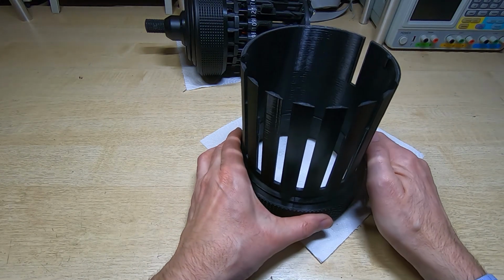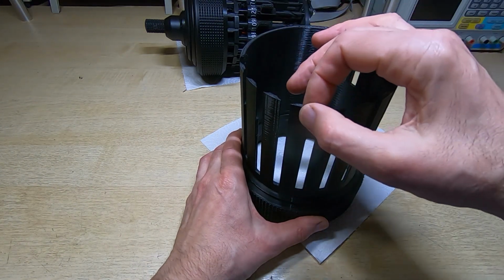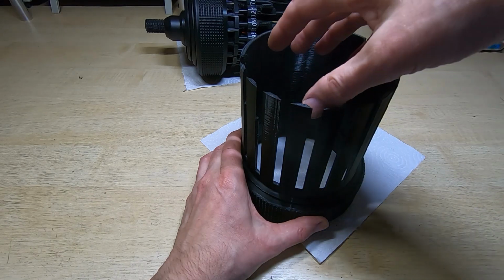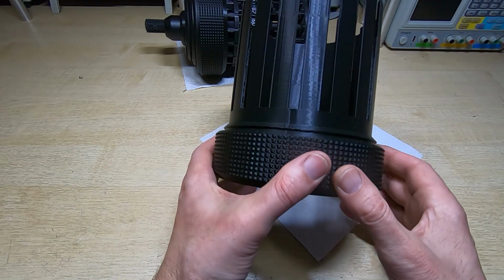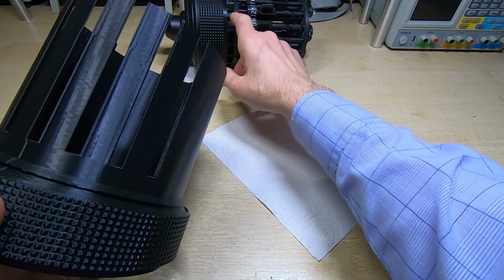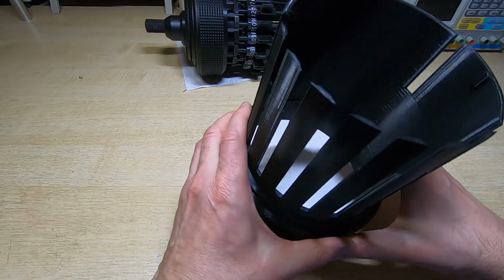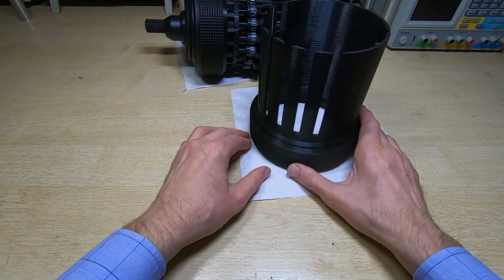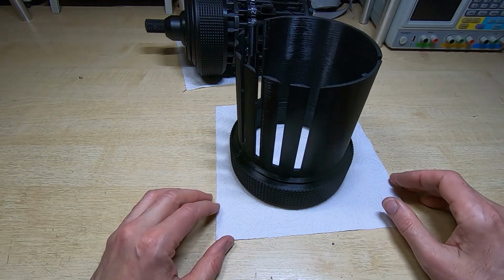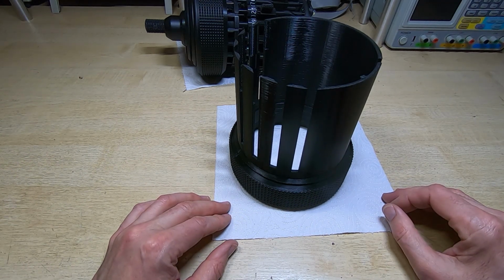Before I rub this down, I'm going to make an insert that goes in here, because otherwise I'll almost certainly snap one of these off. So I'll put something in here that will support these while I'm working on it. Once it's in place, it's fine. These are supported by this upper portion, but with it out like this, it's quite vulnerable to damage. But we're getting there. The calculator is coming along, and hopefully in the next video we should be getting fairly close to completion.